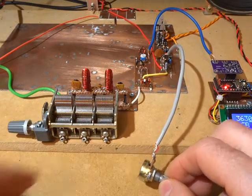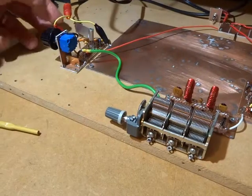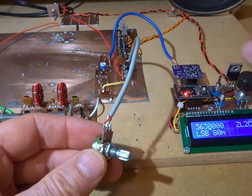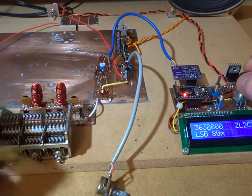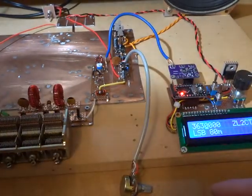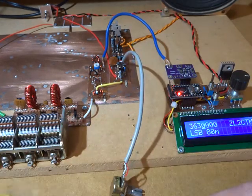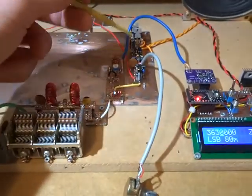80 metres is extremely noisy — it's a shocker. I'll just disconnect the antenna — so this is right there. It's definitely quiet with full volume. Can't hear any rotary encoder noise, which is great. Sometimes you can get earth loops and swishing sounds depending on the setup, but there's none of that, which is great. Let me just turn that back down again and hook up the antenna. Back in business — that's certainly more than enough there, bearing in mind the only amplification in this whole radio at the moment is the input RF amplifier and the AF amplifier running over the back.